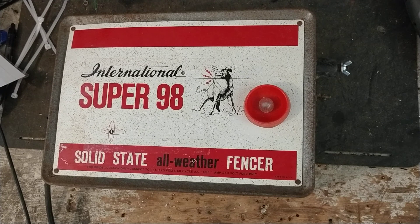We repaired the board inside this unit and replaced the bad output transformer. Not a lot of parts are available for these things, so you have to rebuild the boards that are inside of them. I've got a stack of transformers that are solid state style that work great in these things. A little retrofitting has to be done on them to make them work, but once you get them bolted in and in place, they work like a dream.